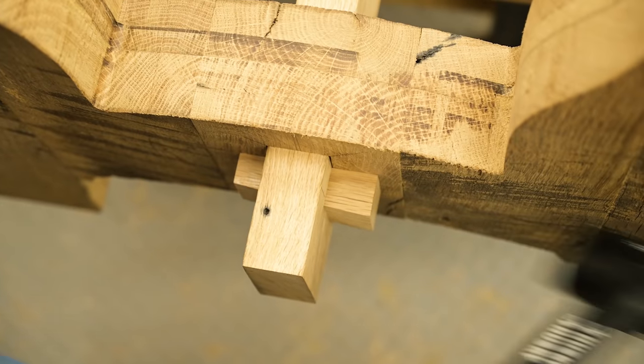However, this time I want to make sure there's no bubbles, so we got the vacuum chamber out to degas. And like before, and anytime you work with pigment, the rule is always make sure you mix adequately. However, since this does have a quick set time, I've got the power drill out with the mixer to help make sure we get it thoroughly mixed, but quickly.